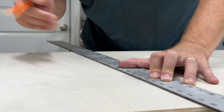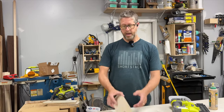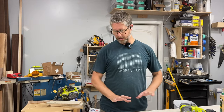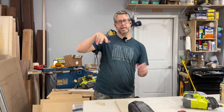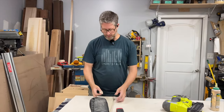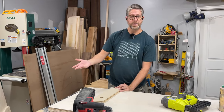I've got the vertical panels for the next box built, and figured that even though I'm not going to assemble the whole thing while I'm down here in the shop — while it's laying flat and easy and I'm not fighting gravity — I can go ahead and put the side supports on there. I've done a bunch of layout marking for where that stuff needs to be. I'll end up having a two-inch stile that goes on the back that we secure into the studs, and I can use an off-cut to make sure I'm flush.